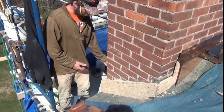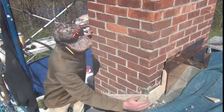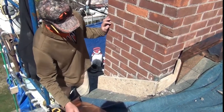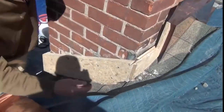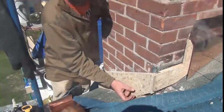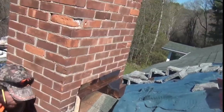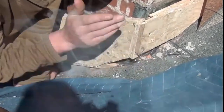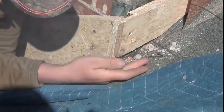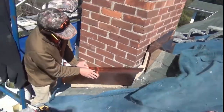We first showed you the simple front panel — most chimneys going through the roof have the front panel as the easiest part. The back gets a little more complicated. You'll notice I've cut this out — there's always an airspace underneath so we do not want standing water wicking up and rotting the back of this Advantech. Where the valley of the cricket comes out is usually the most water-intense area. When this gets re-roofed, they'll put their step flashing right on this face, but for the first 30 years or so water runs here and hits the sub-flashing — which is okay because it's fully flashed. This panel of copper is also going to ride ever so slightly above the shingles.